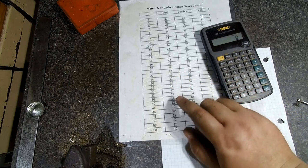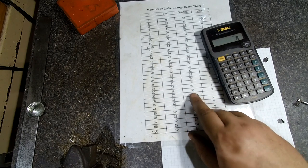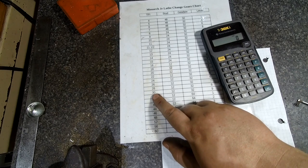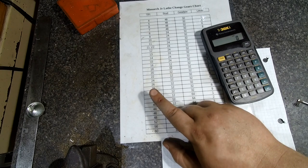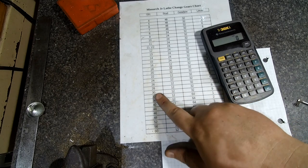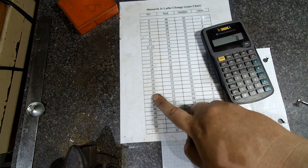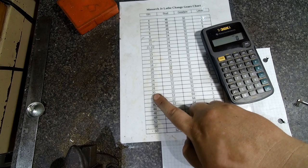And on my lathe, I usually run it at the finest mine can do, because I have the 32 tooth gear going into the gearbox. So it's 30 threads per inch. When I had the indicator stop set up on my lathe ages ago, I actually was curious how much at 30 threads per inch that the lathe actually traveled through the power feed. So I did it up and found out my lathe would do a 4/1000 feed rate at 30 threads per inch.